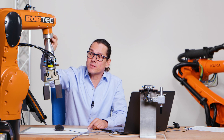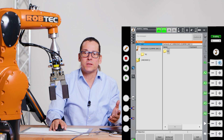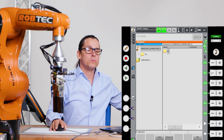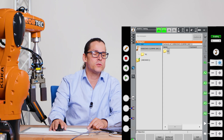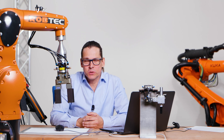So this is axis six, axis one — very easy, isn't it? Maybe you ask yourself: what is single axis movement for? You need to move a robot in single axis when you just want to move the robot around. If you don't know your coordinate system in the robot and you just want to move it away, you do this with axis one, for example.